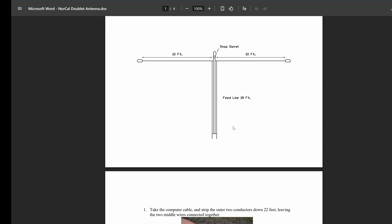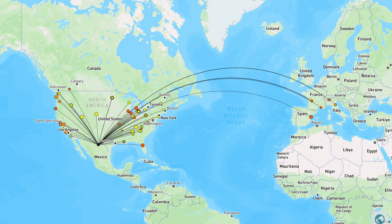For an antenna mostly designed for QRP work, I think it's probably not the best antenna because you're going to have very high losses. I just finished my activation with the NorCal doublet and came up with the same conclusion I had beforehand — it's an okay antenna. I made contacts on four bands: 10 meters through 17 meters, 61 contacts in around an hour. The signal reports were decent, nothing outstanding. I got a little DX — three stations in France, one in Spain, one in Switzerland, and one in England. But I was running 75 watts, and honestly I felt like the 66-foot doublet QRP was better than running 75 watts into the NorCal doublet.